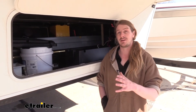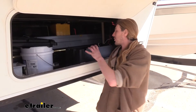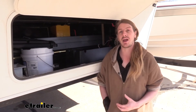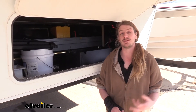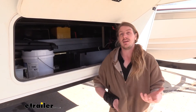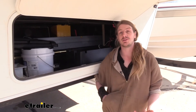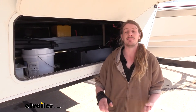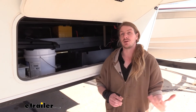If you're interested in solar solutions, Go Power has a whole line of various size solar panels that will fit on your RV regardless of its size, as well as various solar controllers. The controllers all have appropriate charging strategies for lithium batteries, which is important to ensure that whether you're storing or charging your batteries you're doing it at the appropriate rate. Matching the battery with a lithium-compatible controller lets you take advantage of that faster charge time and also slightly increase the life of your battery.